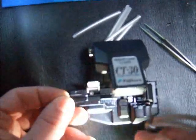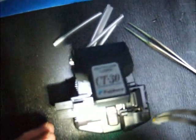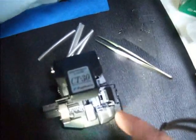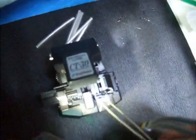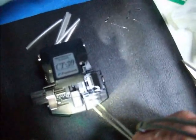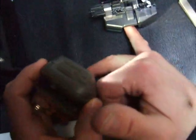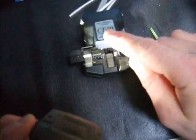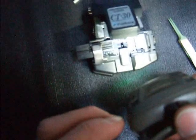Then I close this little magnetic snap, and that holds the fiber very nicely in place. There are different channels for different sizes, and you can see the fiber goes all the way over to the other side to the little roller right there. This piece will snap down, pull the piece of fiber into the discard tray. I've already pressed the button down here to wind up the cleaver, and now all I do is this — it snaps down, pulls the fiber through. You can see the fiber is cut right there.